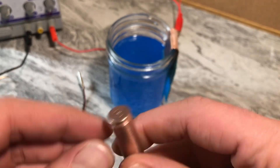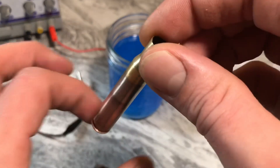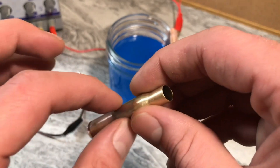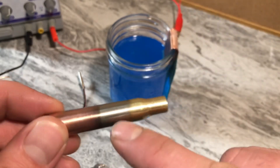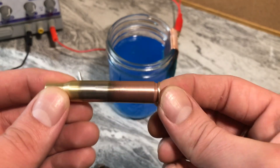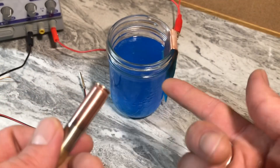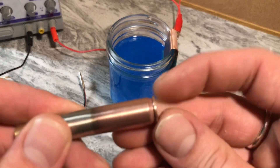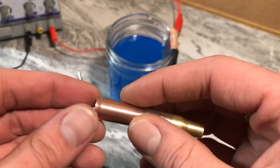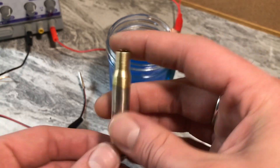I think I'm going to have a lot of fun with this copper plating. And you're not going to have these lines between plates when I plate my good stuff, because I'm going to have the whole part submerged. I wanted to keep some brass, some nickel, and some copper on just so you could see the three stages. I'm pretty impressed — this actually works really good. That guy was right; this is a really good method. That copper is on there strong with a really good finish — not quite mirror, but high polish for sure. I'm really impressed.